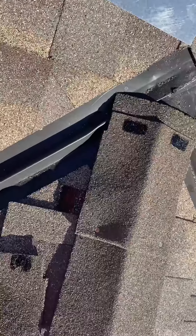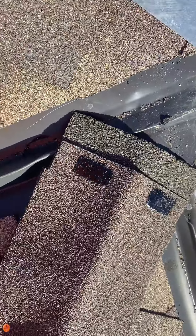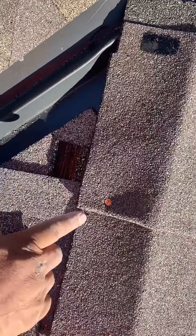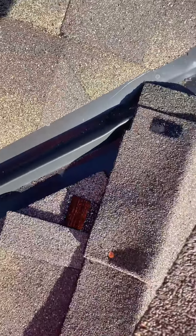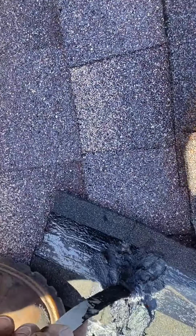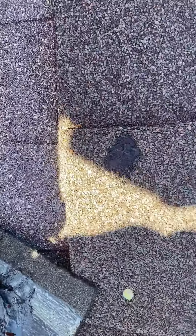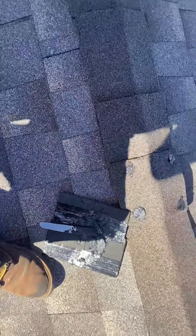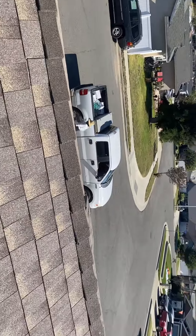This is a simple tutorial. When you get to the valley, you're supposed to nail right there, but don't nail in the valley — instead just nail in the front. Later you can seal them. I use a little bit of black tar mastic plastic cement, and when I finish it looks like this.